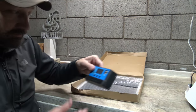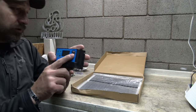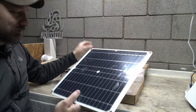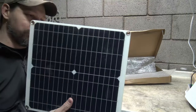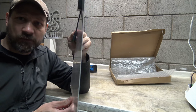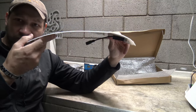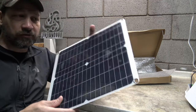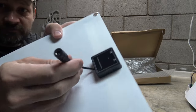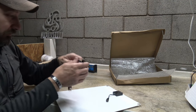It comes with all these accessories. The charge controller is very basic, but you do get two USB ports, which is pretty cool. Now here's where the specs get interesting: they claim this panel is 100 watts — there is no way this little panel puts out 100 watts. It reminds me of a flexible panel — very small, very lightweight, slightly flexible. On the back you've got the 5.5 by 2.1mm female adapter, and everything plugs into that, including for direct battery charging.